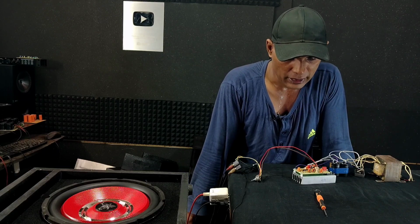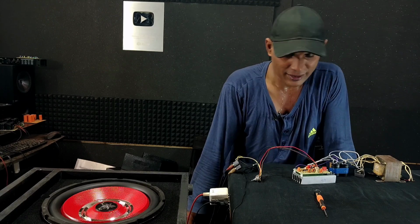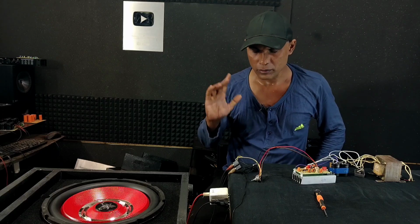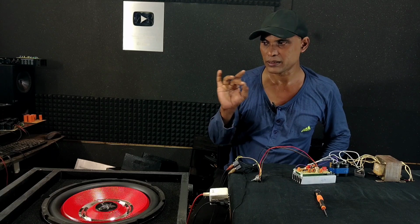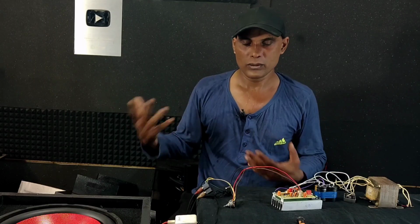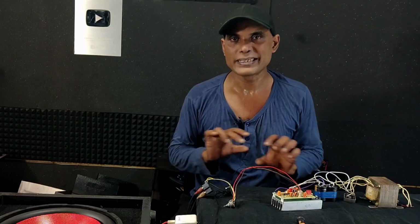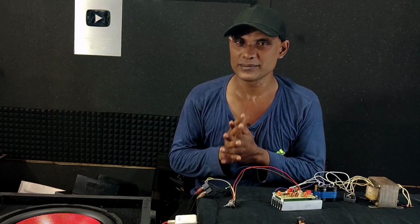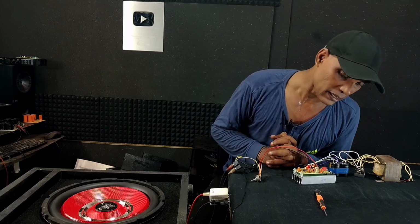The performance was shown just now, and I'm satisfied. It's working wonderfully. I think the price is almost 900 plus, with courier charge it may be around 1000. If you are assembling amplifiers for sale or for anything, you can also try this special board, mini bed type VI Audio 100 watts subwoofer amp. It uses a pair of 5200 and 1943 transistors.